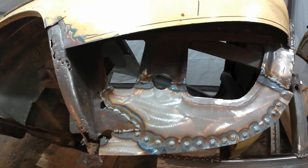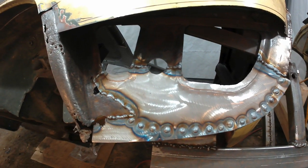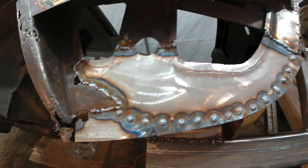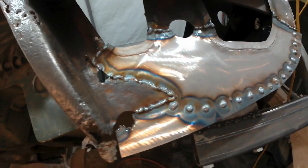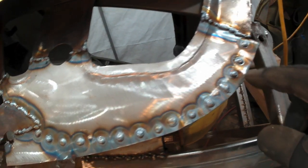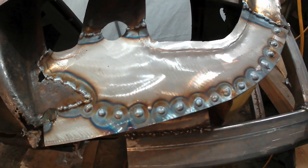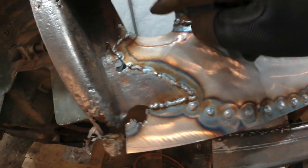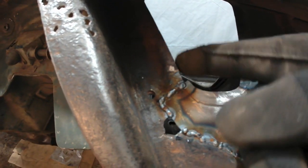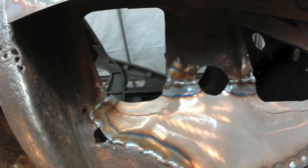The patch at the bottom of the stiffener is now welded into place. Got all of the seams done, and all of the tack welds done. I just have to grind it back now. In some spots I've left a little bit of extra meat on the bone, so I can grind that back later to get the right shape. A little bit of fussing to do in here to tie these pieces together. That patch that I cut doesn't quite match up with the original, so I'll get the die grinder out and get that cleaned up.